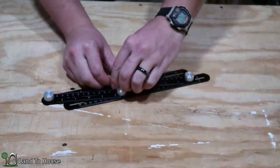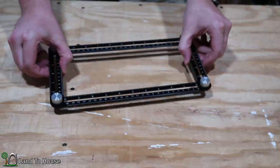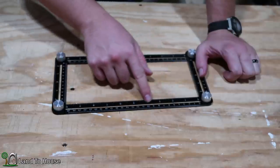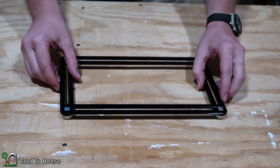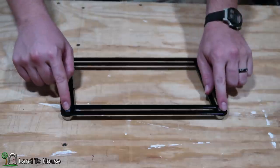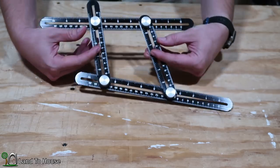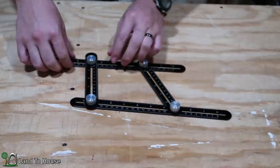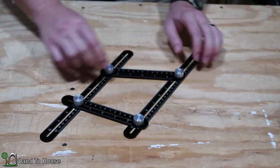This has four different knobs, all aluminum, and it has the tool here that has both the centimeter side and the inch side on each of the four sides. The back side is unmarked, but it does have these square nuts that slide in these tracks, and that's what allows you to cinch this thing down at any point. So you can find your angle, whatever it may be, lock it down, and then transfer it to a new surface and mark it out.